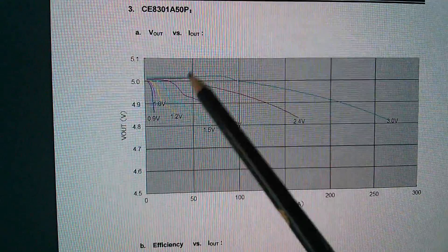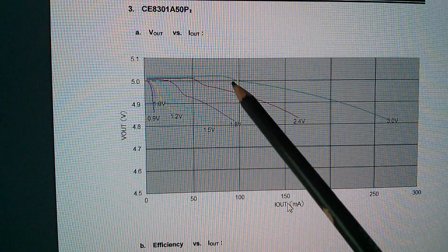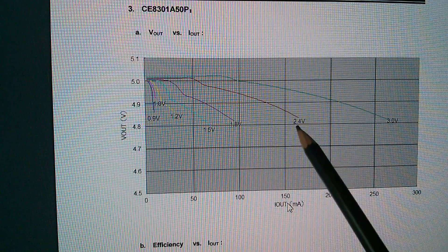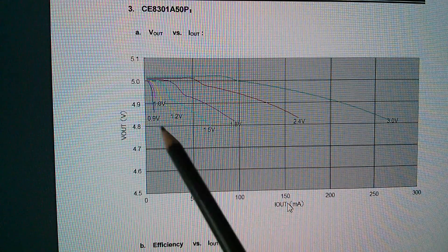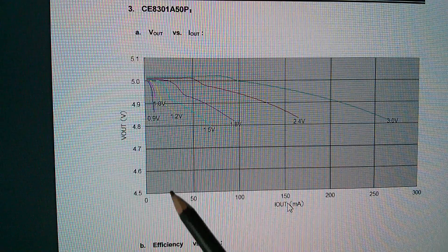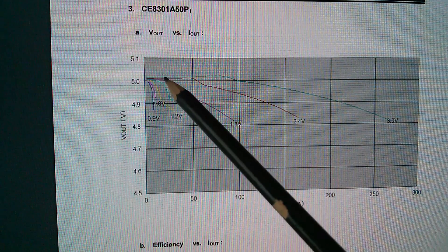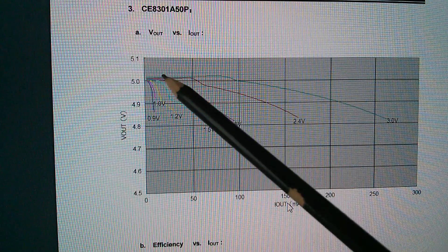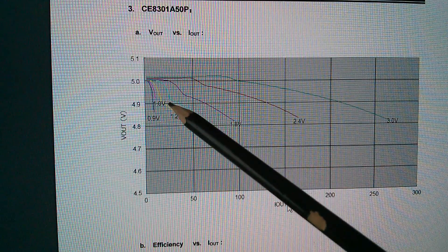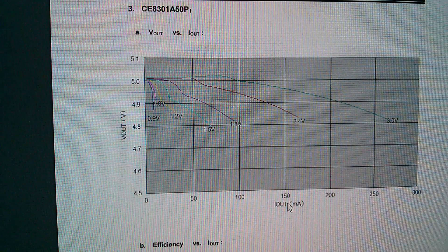You've got to be a little bit careful here. If you put 3 volts in, you can only draw 5 volts out up to about 100 milliamps. And if you put correspondingly less voltage on the input - like 1.2 volts here - you can't really get much more than 10 or 20 milliamps with 5 volts out. You can get a little more current at a lower output voltage, but things drop off very rapidly when you're at 1 volt or 0.9 volts going into this device.